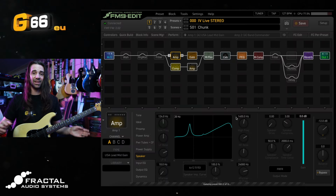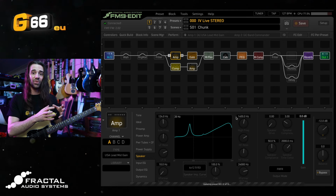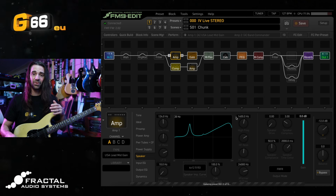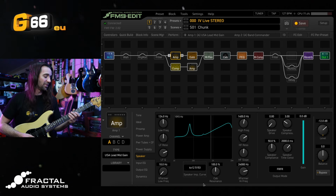What it's going to do is, in all of those presets, change this impedance curve parameter to the one that I've selected here. So you can see it goes through all of the channels, or whatever channel I've selected, and it saves the presets. And then I'll give you an example very quickly. You can see in here, my main speaker impedance curve is this 4x12